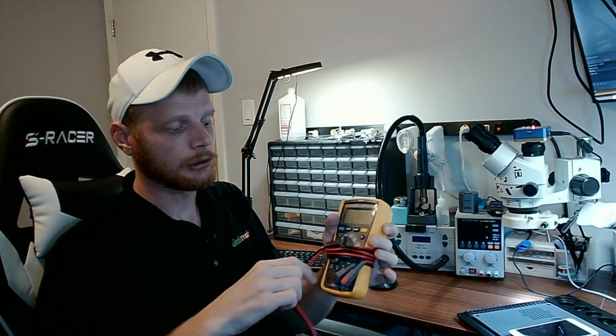And that is the use of diode mode on the multimeter, okay? Diode mode is a very useful tool. It pretty much tells us if the line is open, closed, or the reading on the line. And what you'll see in ZXW, and we'll get there, is that ZXW will normally have the readings right on the board view that they have there, and if they don't have them, normally LogiWiki has them. So with the variety of tools, normally good measurements are out there.